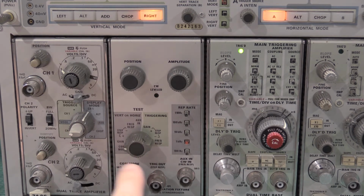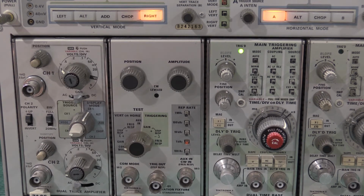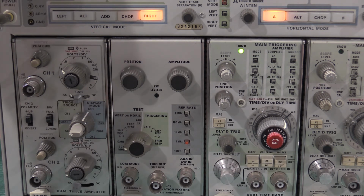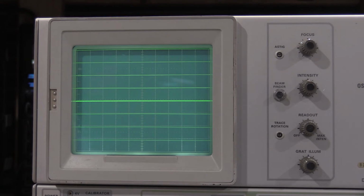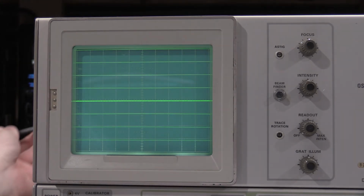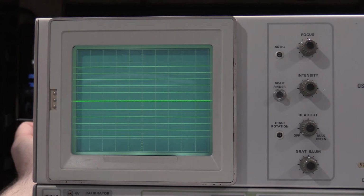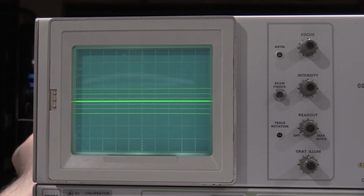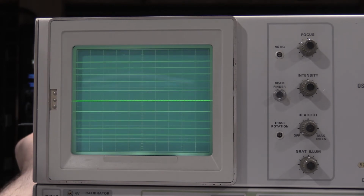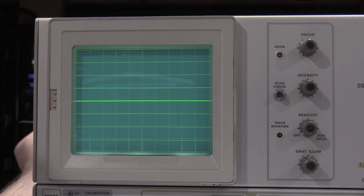Okay, so using the signal standardizer, we're on vertical or horizontal gain, 1 kilohertz rep rate. I'm adjusting 4415 for maximum deflection between the traces. All I'm looking for is maximum deflection. So let me find 4415. That is in figure 632. So, misadjusted. As I'm rotating it through its ranges, it's accordioning. So we want to hit it. That's a little too far. A little too far. Right there. There we go.